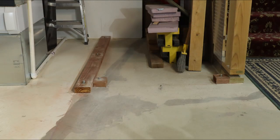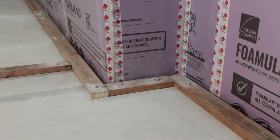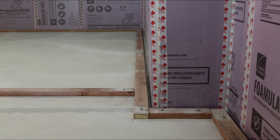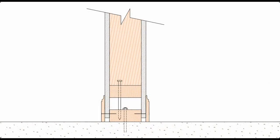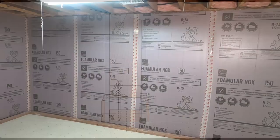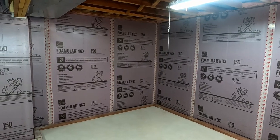If the floor should ever rise a ½ inch, I may need to adjust. I use 6 inch spikes to allow for the soil to shrink and the floor to drop up to 1½ inches, but I do not expect this to ever happen. I will leave an ⅛ inch gap under the door jambs and door casement above the finished floor to provide a gauge to detect any movement in the floor. The door jambs and door casement are attached to the frame walls, which are stationary. I do not show this in my drawing, but picture the drywall with only an ⅛ inch gap. Again, I do not expect to ever see movement in the floor, but I would be remiss to not float the walls.